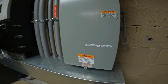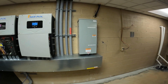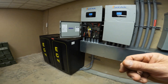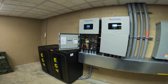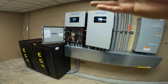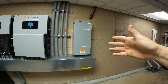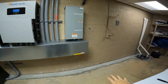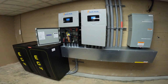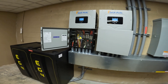Put a bypass in. Yes, it's going to cost you five or six hundred dollars, but you do not know the scenario. There could be a BMS failure, a screen goes out, something unexpected happens with the system. Are you going to wait until you have to replace an inverter or a battery? We went five days back on the grid, back on bypass, waiting for the concrete to cure. Then we just reinstalled the system — that's exactly when you'll want it.